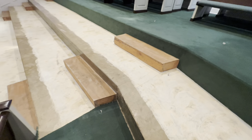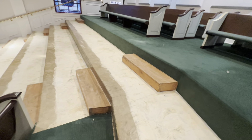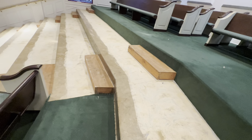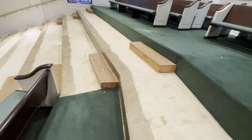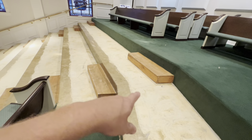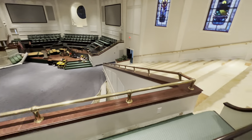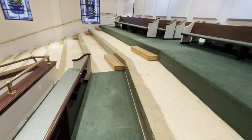What I was fixing to say when I was talking about the carpet glue - after it tacks up, the stuff does hold real good. It is a good glue, it's just a little runnier than I would like, and it takes a while to set up because it is runnier. I was thinking about totally putting a different flooring adhesive on these right here, but since I am now having good results out of the glue down here - it holds beast mode whenever it gets tacky, it holds really well - so I'm okay with it.